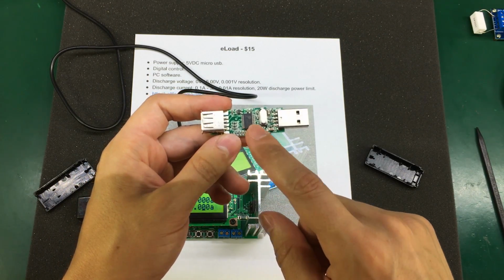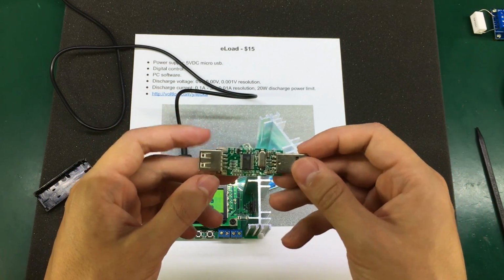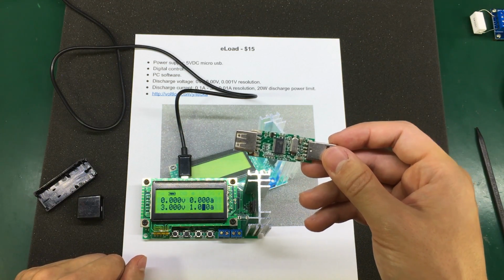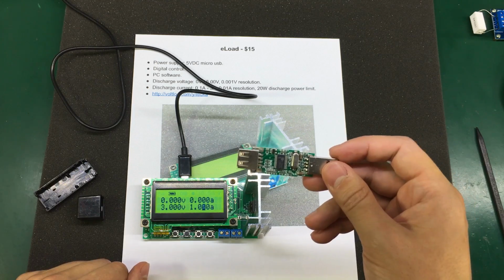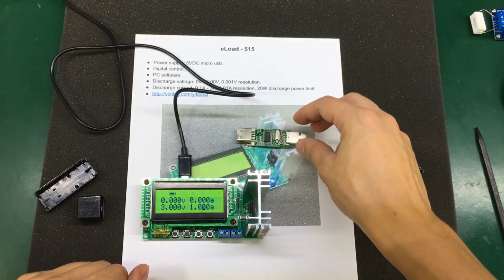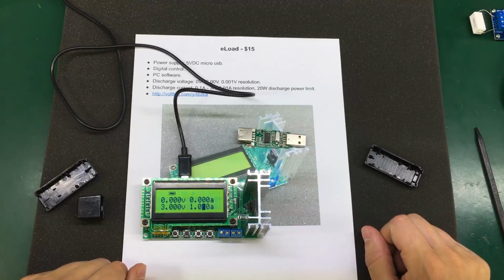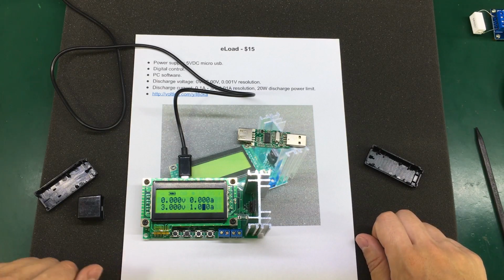But actually I think there is a clone of the PL2303, because if you try to install the latest version of the driver from Prolific, it will not work, at least on my computer on Windows 7. I think they've done something similar to what FTDI did with their driver, and they're blocking non-genuine chips from working. Also, the driver supplied in the zip archive together with the DummyLoad app doesn't work at all. It fails every time I try to run it on my Windows 7 64-bit machine.